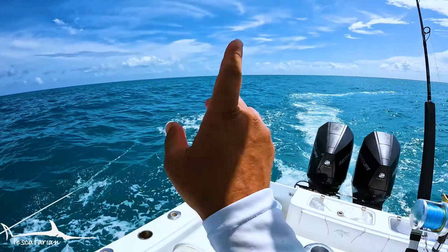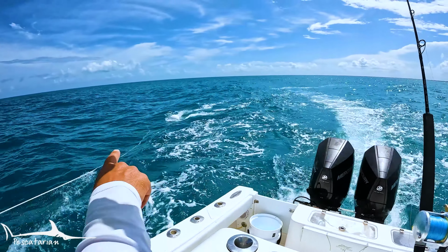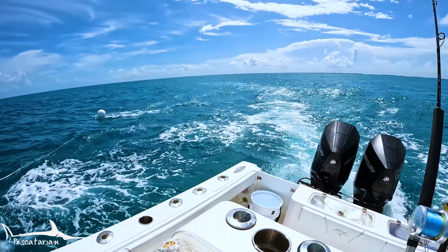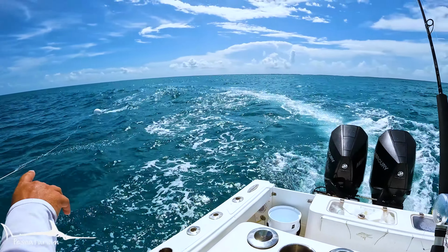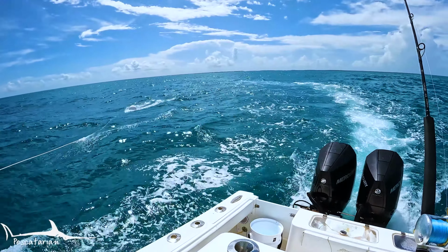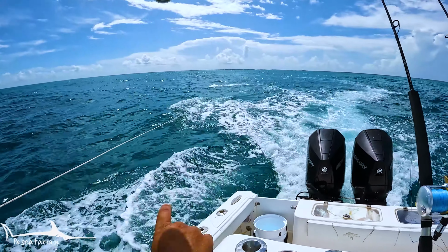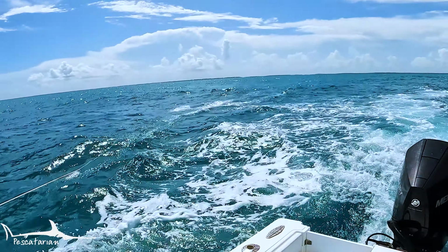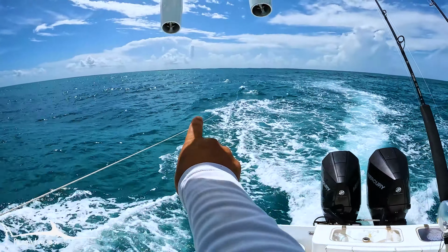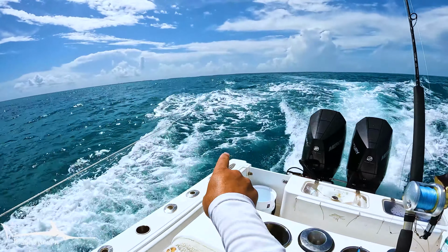You can see here, hopefully this camera here is catching it. We've got the line going out right here. You could run closer to it. You could run in a circle. But essentially what you want to do is keep pulling this. And you can see the anchor ball there. There you go. You saw how the anchor ball just popped up right there. Now your anchor is released off of the ocean floor.